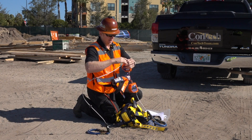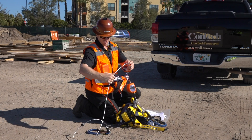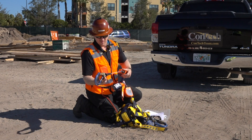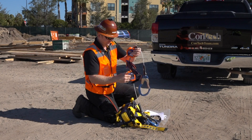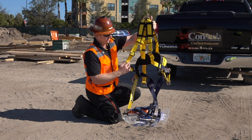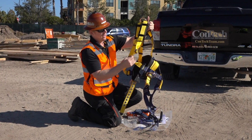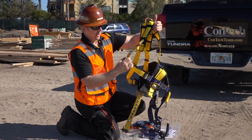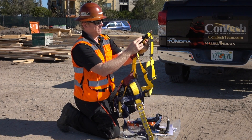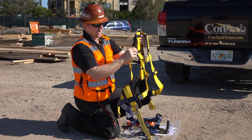Do both sides and check it all out. This is brand new out of the box, but you don't know if there's a manufacturer defect or shipping issue that could damage it. So you're checking all the cable, locks — make sure they're in good shape, pans in good shape. Same thing with the harness. Even though it's new, somebody that opened the box might have cut the webbing. Check all of the harness webbing for any rips, any tears, any frays. The D-ring — make sure it's free of any cracks, any bends, gouges, or rust.